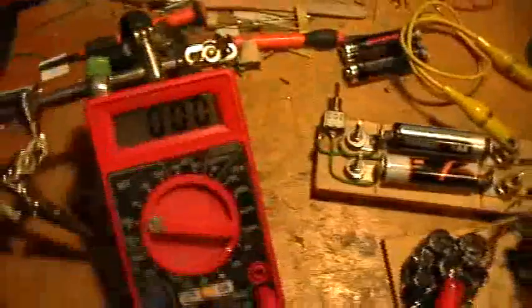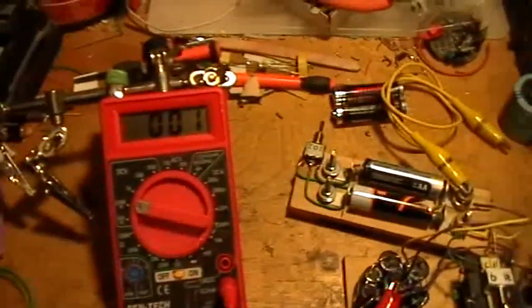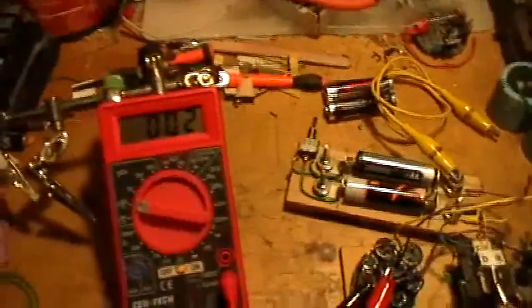It's not unusual for capacitors like that to spontaneously recharge. I'm going to take this little jumper and short out the capacitor bank — the battery is off but it's connected to the capacitor bank. I'll short these terminals here, shorting the bank without blocking the camera. There I've shorted the bank, and I'm leaving it shorted for a while. Now when I take the shorting strap off, you'll see it climb back up a little bit.